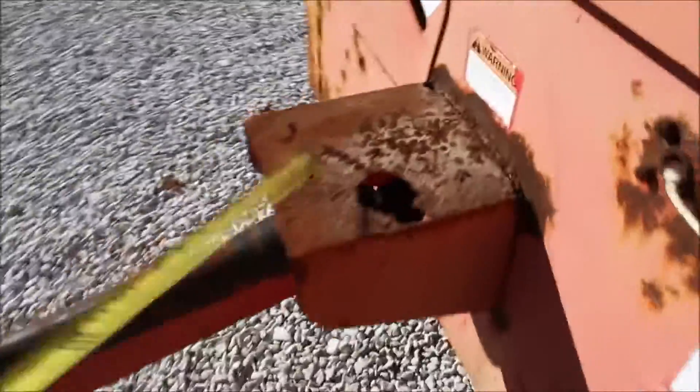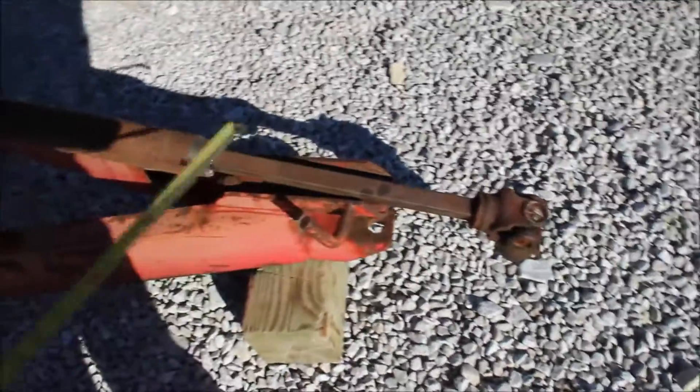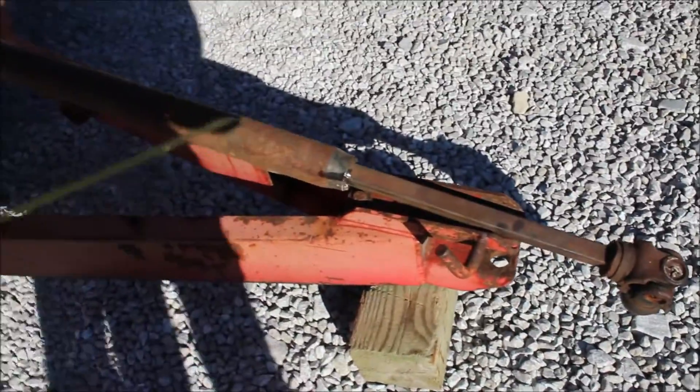It's rusted out on this shield, but that's just a shield over the PTO where some manure got set. In general, galvanized sides, plastic on the bottom. This shaft has a little kink in it and will only go in this far. It hooks up to the tractor, but depending on what you hook it on, you may or may not have to work on this, because it only goes in and stops right there.